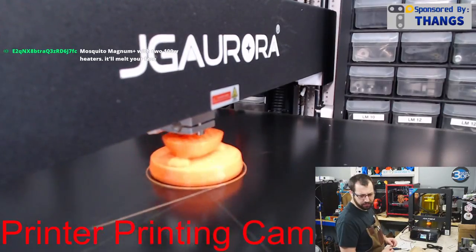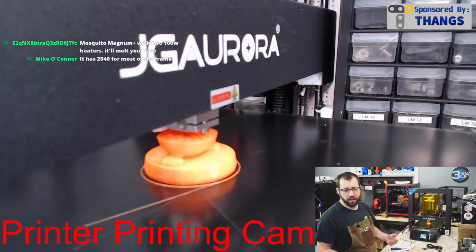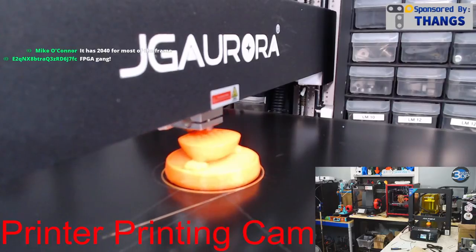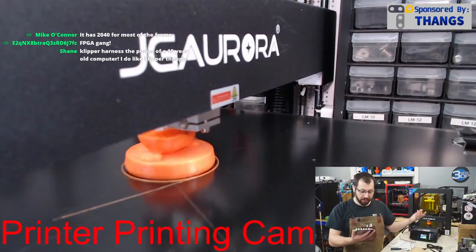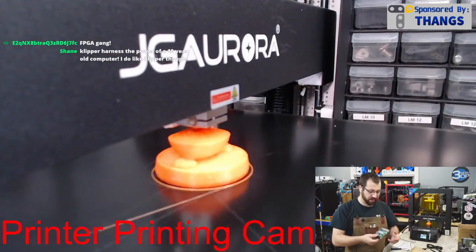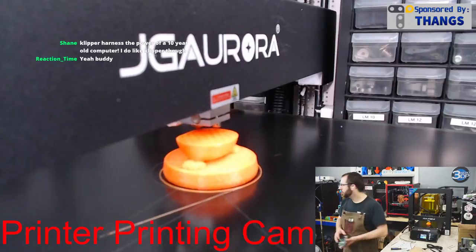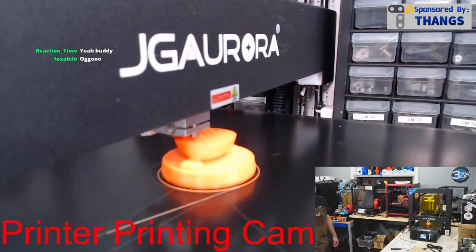Self-built i3 type frame with a Duet and Wi-Fi for 100. Oh, that's not bad. A Duet 2 is still a great controller board. I still have my Duet 2. I really want to put it in something. Because it's got a good processor, it's got all the inputs, and it's got five beefy stepper drivers, like 2660s. Yeah, you don't have things like StealthChop, but I don't run StealthChop anyways. I'd rather have the extra torque. So it's still a good board. It runs Klipper great.